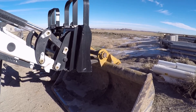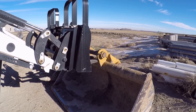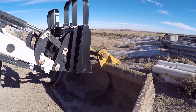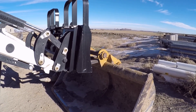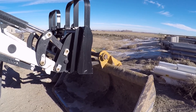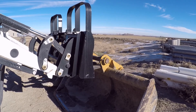They can't seem to get the hydrostat to work properly. They've been doing some testing — I just got it back, they've had it for almost three weeks trying to figure out what's going on. They've decided that their best bet is to replace the hydrostat and the hydraulic pump, and they think that's all tied together. The hydraulic pump isn't producing enough to get the lift capacity or get the hydrostat to work properly.